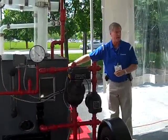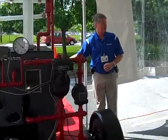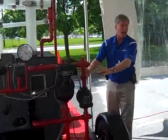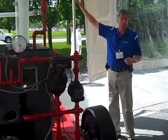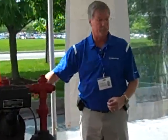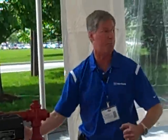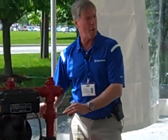What can you possibly do to prevent all that stuff out in your system from coming back to your boiler? If you have a boiler feed tank system, that's great. Or even if you have a gravity return system coming in, get yourself a bucket trap. Slap a bucket trap on the return. Sever that return pipe — don't let any of that water come back to your boiler. All that crud has been out there for 70-plus years. Find a way to get rid of that, pump it somewhere else. But you need to control it coming back. You can't let steam come bellowing back into the system, so you need to put a trap on the end of that. Not every job is applicable to that, so keep that in mind.